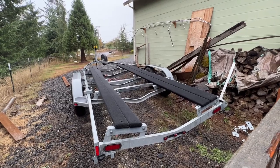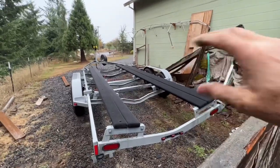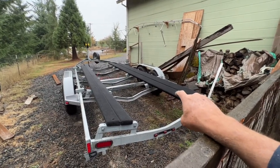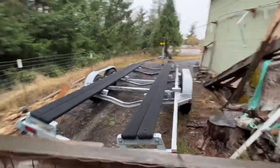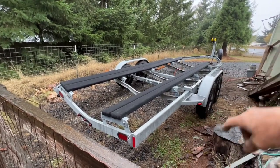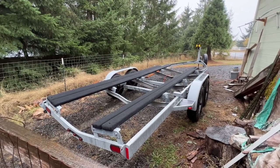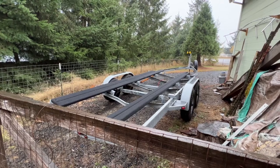I had to spend a couple of extra days getting the trailer modified to fit the bottom. I'd already done lots of structural work on it, setting up the bed and everything else, but what I kind of screwed up is I didn't have the bunks spaced correctly for the strakes on the bottom of the boat — it was just going to be really tough to load the boat without the strakes sitting on the bunks. So I remeasured everything, cut off a bunch of supports, lowered the bed, added brackets, all new hardware, and then a couple of extra two-by-sixes with carpeting on them. I think it's really solid, it's going to be fine.